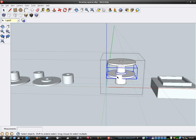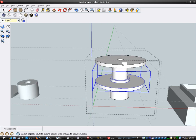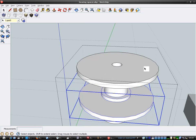Oh, I'm sorry you can't see what I'm doing right now, but I'm basically trimming off the edges of the objects I've just printed. Yeah, so let's see how big this is. Alright, that's measuring 26.35 millimeters that way, 24.77 that way. So yeah, it's definitely come out oval shaped. Well, I'll be alright when I get that pulley. I've got two pulleys coming.